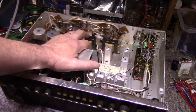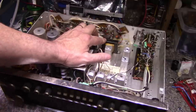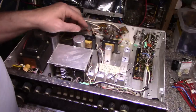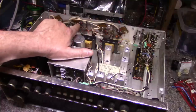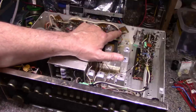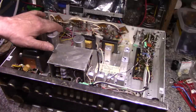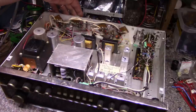When he said it smokes, I was envisioning one of these two transformers being cooked like in another receiver I had — but these ones actually look okay; I don't see anything that looks like they overheated. But I do see two resistors that are crispy-fried: one is a 0.27 and another 0.27 here. Red-violet-silver-silver — 0.27 ohms. So in these cobwebs there are two burnt resistors. That's going to be our smoke channel, and these output devices are probably fried.